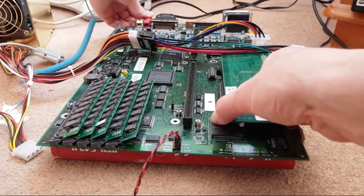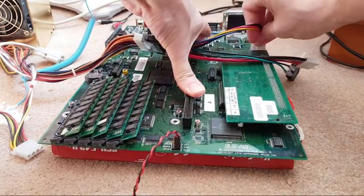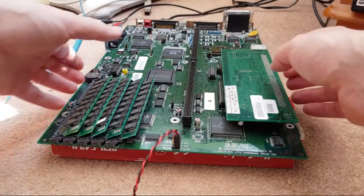when you've not got a drive connected. It should wait longer than that. Normally you have to stick the IDE terminator on there. Got one coming, but it's not arrived yet. Yeah, you have to stick an IDE terminator on there to cause that kind of behaviour.